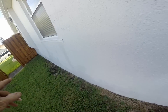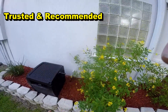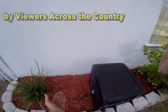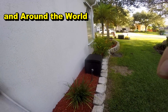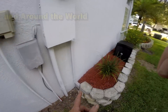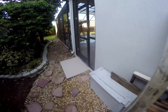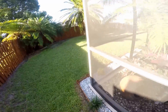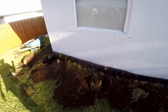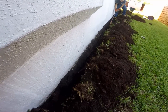Water has been coming up in these bedrooms in the back. Here in Melbourne, Florida you can see there's a lot going on — they've got this raised bed, and even though there's stucco and brick back there, water is going to get through and into the walls. Sandy soils drain away quickly, but you never want soil to be above the slab. Florida homes have specific problems: thunderstorms are severe, water can come down two to three inches in an hour. Downspout drains from the gutters really need to be put underground and taken away from the house. Depending on construction, that groundwater will rise up and enter through the floor at the wall.